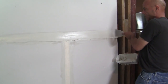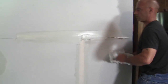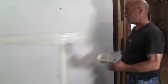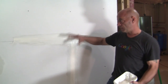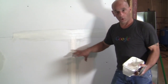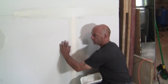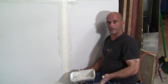Go right in the center like that, then go to the outside edges — same thing as before. The sheetrock tape joints are beveled on both sides, so we can build that up quite a bit before it shows. This is where the butt tape for our butt joint really comes in, because we want a strong bond and we know we've got it with this tape. With flat sheetrock meeting flat sheetrock, we're building this out.